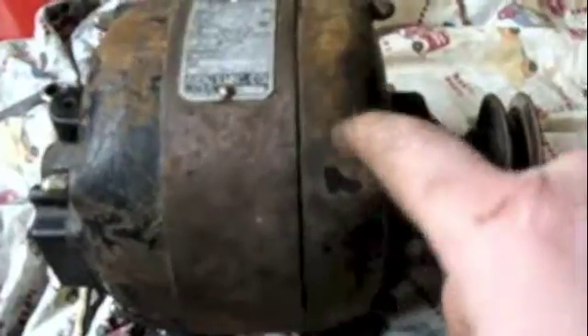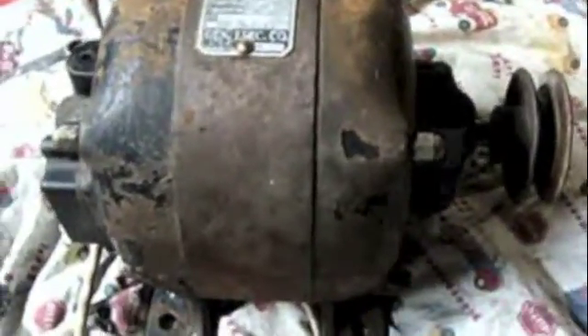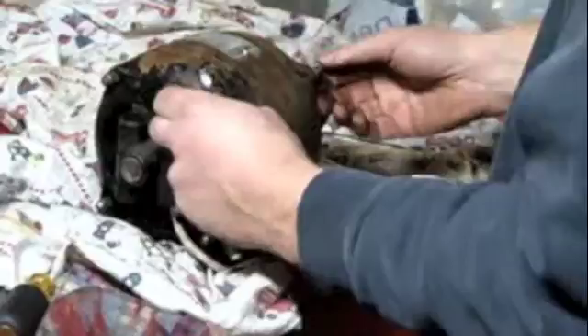I can't remember whether you need to look at the motor from the back or the front when determining rotation. What I'm wondering is - you've got the end sections of the motor and the center section here. This is probably a through-bolt design, meaning if I take these end caps off, I can take each section off. The question is: could I swap the ends and actually end up changing direction? On some motors that won't change anything - it really depends on the design.